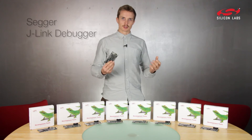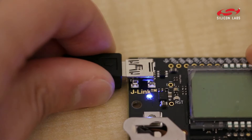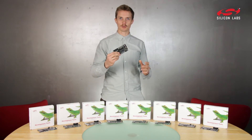Common features include the J-Link Debugger. This allows you to get started very easily just by plugging it into the computer with the included USB cable. And when you plug it into your computer, you will also get this card up as a mass storage device, so you can just take your pre-compiled binary and drag and drop it over to this.